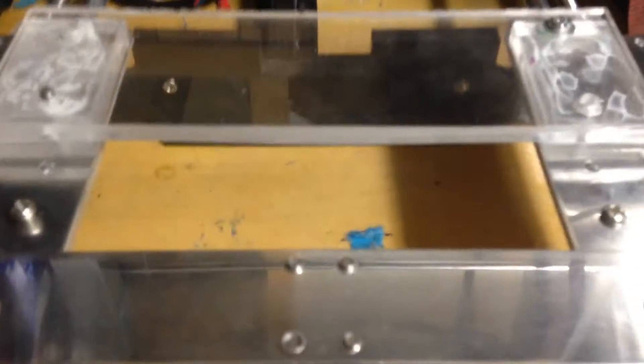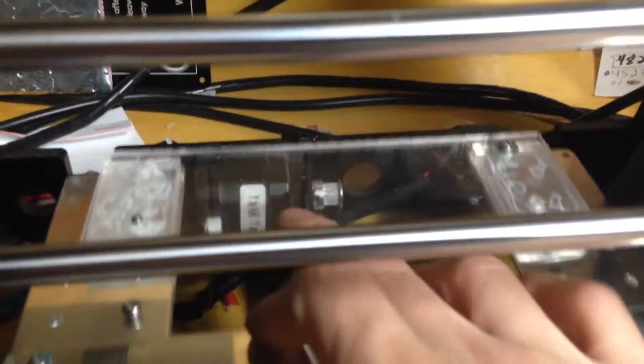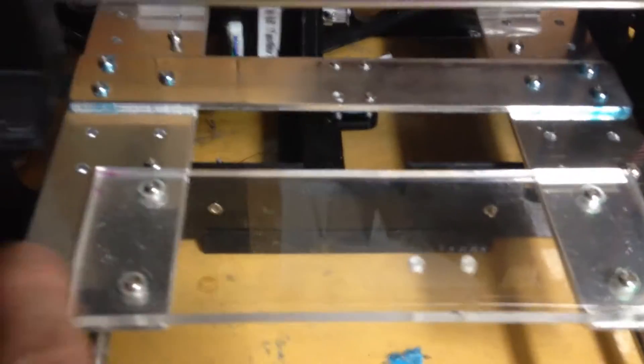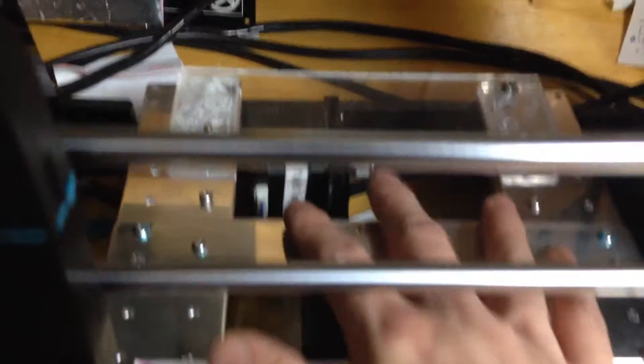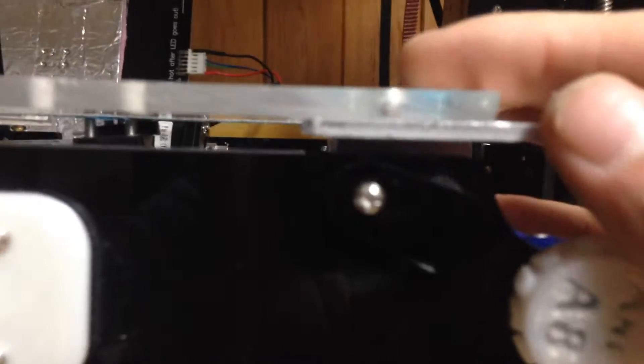On this side in the back, I had to go two levels high and put a spacer under there because the extruder in the back gets in the way - it clears it now with the spacer. I wasn't able to put both flat like this. In the STL file, just make sure you use the right length screws, because over here the screw is barely sticking out. If it stuck out too far, it might hit the frame.